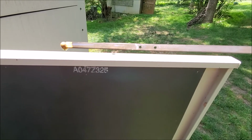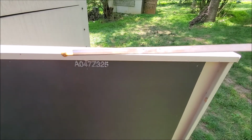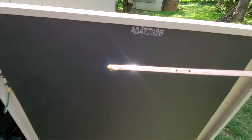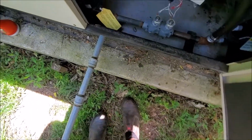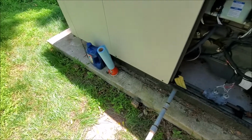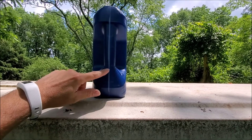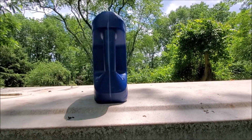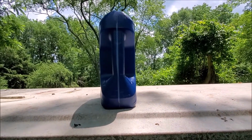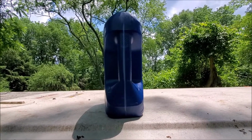So obviously some of the oil's gone into the oil filter, which you'd expect. So it's going to take a little more. And so far I've put 3.5 containers in. It does call for 4. So yeah, we'll give it some more. Alright, so I just double checked. Once again, got 1 3/4 litres left in my last container, sorry, container number 4, and it's perfectly full of oil, so it's right between the 2 holes in the dipstick, which is where it should be.